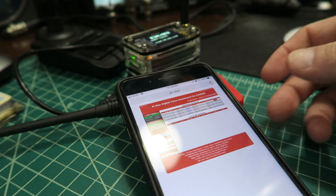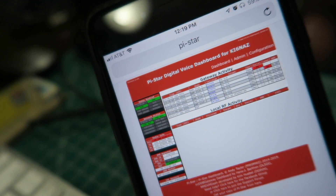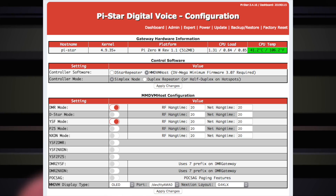This is a strong buy. If you are into digital mobile radio — DMR, D-Star, or Yaesu System Fusion — you pretty much need a hotspot. There's nothing wrong with using repeaters when available, but there's a certain level of freedom that comes with having a hotspot. The reason I like the ZoomSpot, particularly with the screen, is you have multiple modes you can operate on and cross-link — DMR to Yaesu System Fusion, Yaesu System Fusion to DMR, or P25. There are lots of cross-linking options, which is really nice if you only have one radio.